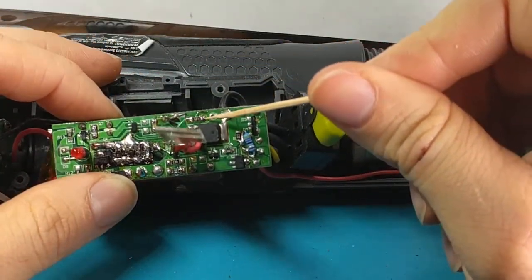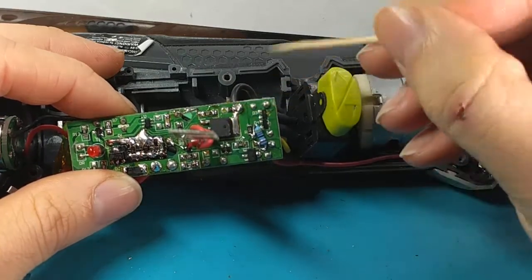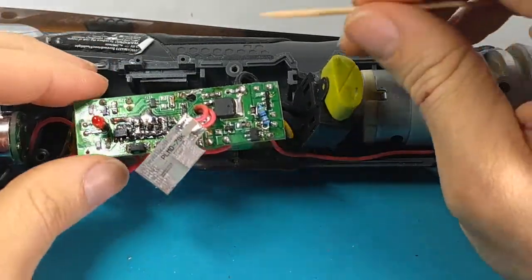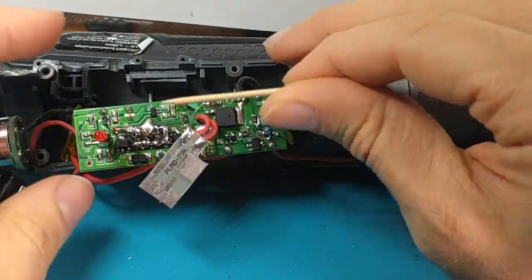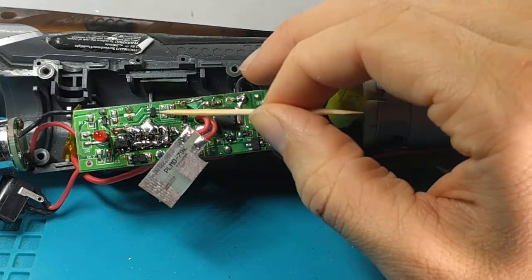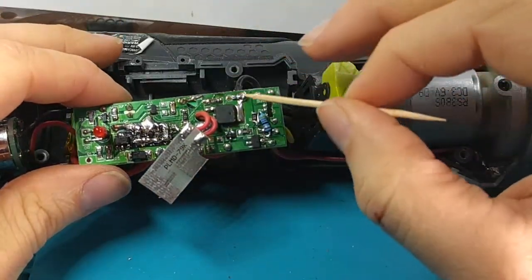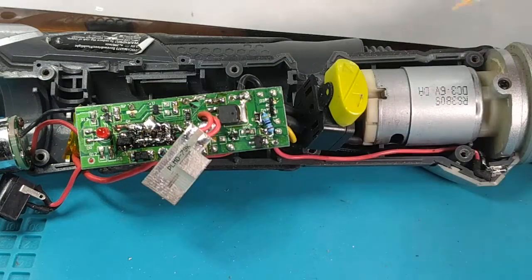I went ahead and put the original 680-ohm resistor back in — this is the current-sensing resistor for the MOSFET. For some reason it wasn't working before, so I had to use a different one, which I've now left there as a backup. But the old resistor now works — maybe because I swapped out the FET. How this works: it's all controlled by this chip right here, the S-8261, which is a lithium-ion discharge controller. What's cool is the whole thing is essentially a lithium-ion protection circuit, but instead of using the MOSFET only for protection, it's also using it for driving the motor.